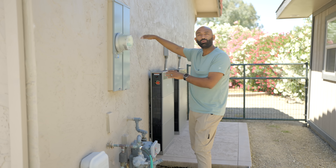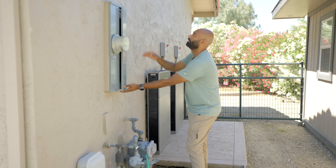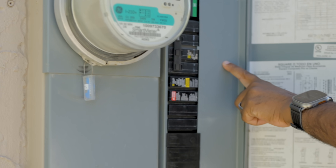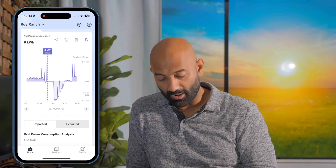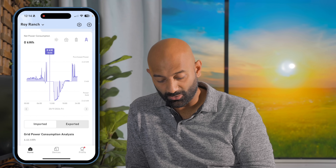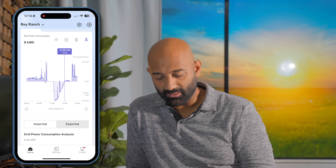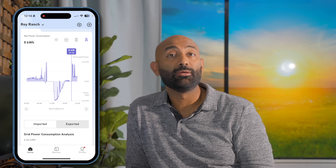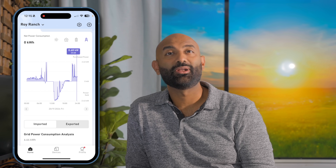By putting the batteries outside, we don't lose room inside the garage. This is the main circuit breaker, and as you can see in the main service panel, the main 200-amp service comes from the grid and everything else has been moved — meaning their entire house is backed up. In the app, you can see grid interactions: once the sun comes up, the battery is charging. When full, it exports to the grid. Then from about 4 PM to 9 PM, they have zero grid usage. The battery is programmed to go back to pulling from the grid at 9 PM.